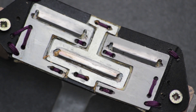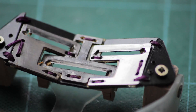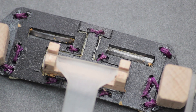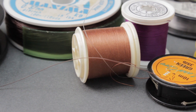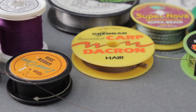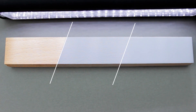Joining dissimilar materials can be tricky — you can search the internet for appropriate adhesives, or rivet different materials together. But never forget lashing and stitching: it's what our ancestors used to join flint spearheads to a wooden shaft, and when prototyping it comes in really handy. I always glue my stitching for extra strength. When looking for strong threads and lines, don't forget fishing tackle shops — they sell all sorts of threads, braids, and wires which can come in very handy.